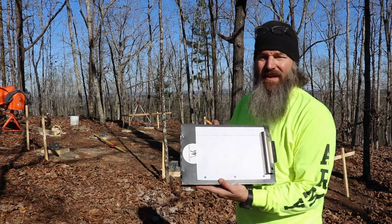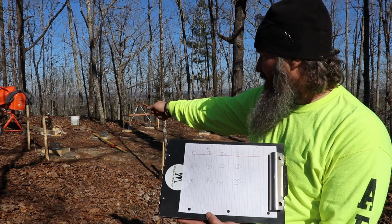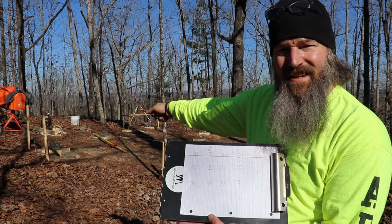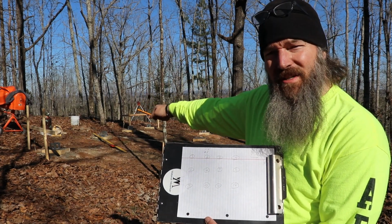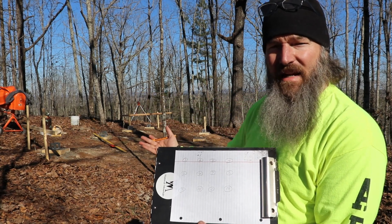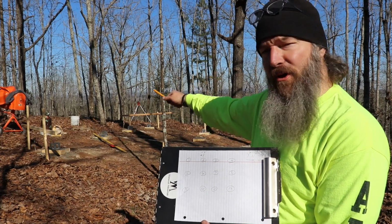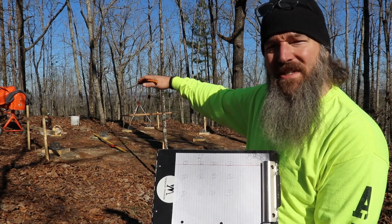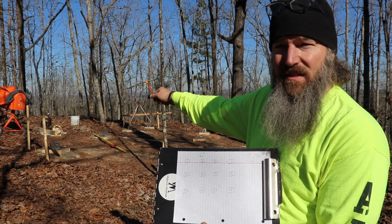Okay, so what we did, right? We started at 1 foot, 11 inches on our base post right here. So now we're gonna make that a 36 inch post because I want at least 30 inches of clearance underneath the cabin. Thanks to the boss of the swamp, you gotta keep him happy. So we want 30 inch clearance. So I'm gonna do 36 inch post right here to start out because we're using two by sixes.